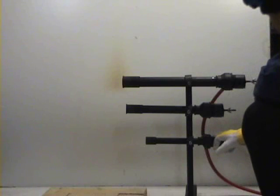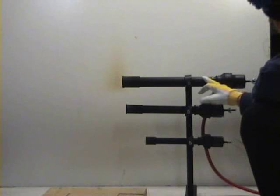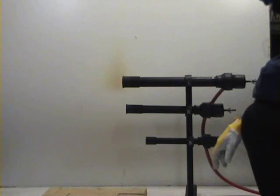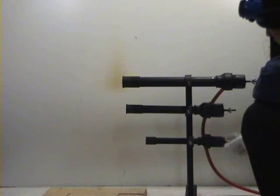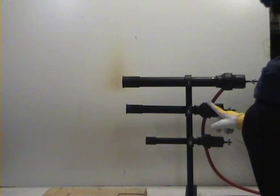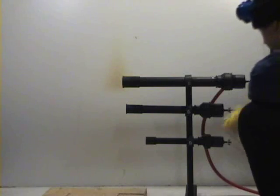This is DFP, the smallest burner. This is DFC, the medium burner, and this is DFM, the monster big burner. But first, air chokes. You have to close them, but leave a little bit of space for air when you're starting the burner. Of course, when it is installed in a forge, you don't have to do it.